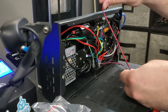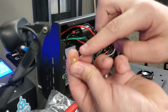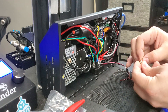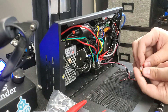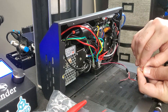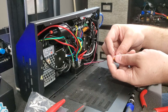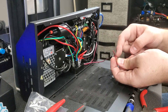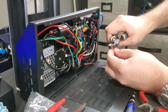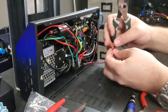All we have left is connecting the wires. I don't need this much wire, so I'll trim them. How these connectors work: you put your two wires in and squeeze the connector with pliers to crimp them together, matching colors — two red wires into one connector, two black wires into the other. If the wire doesn't want to go in all the way, rotate it as you insert it and it'll work its way up. You want the wire to reach all the way because the crimp part is about halfway in. Use needle-nose pliers to push the wire in past the crimp, then squeeze both sides down so the orange piece is flush with the clear piece. Give the wires a little tug — if they stay in, you're good. Repeat for the other side.